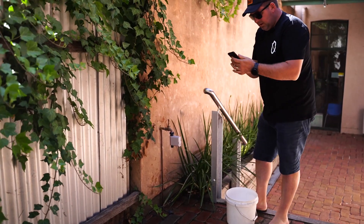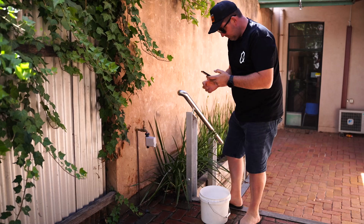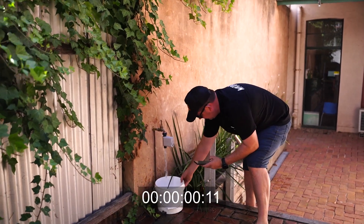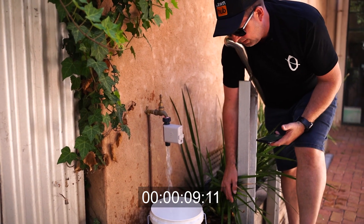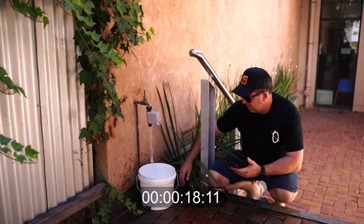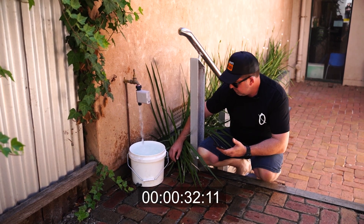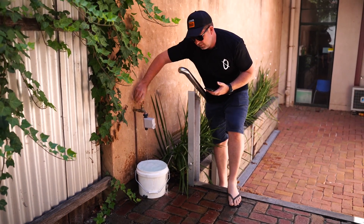Tap right on. You can see visually straight away, that's a lot slower. There's a noticeable change. It looks like there's less pressure, but maybe similar flow. So this client might be having a pressure issue. We're at 31 now, and we're probably going to fill that bucket out to 35 seconds. So it's close, but it could be all the difference.